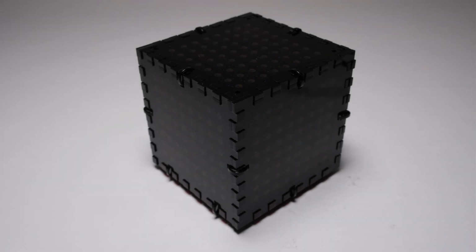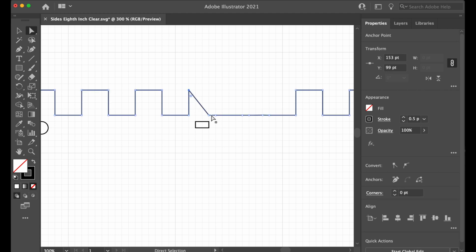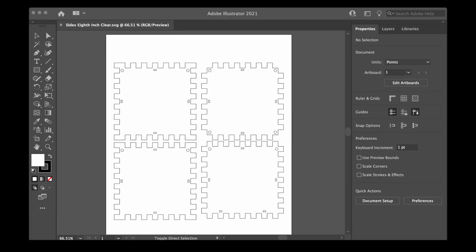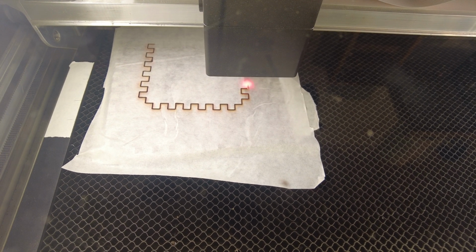Okay, now let's see how Complement Cube was constructed. Box design was done in Adobe Illustrator and saved as an SVG file. Besides the basic box outline, all holes for screws, knobs, and cable ties are included. Occasionally, I will use processing to create algorithmically generated SVG files through programming, but not on this project. The SVG file is then sent to my Glowforge laser cutter.